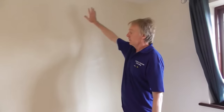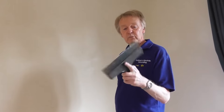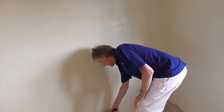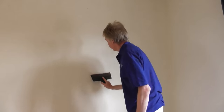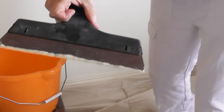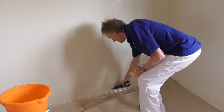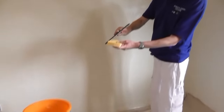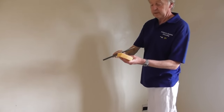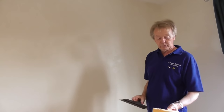I've already soaked this part of the wall with some warm, clean water. Now I'm going to be using this tool to get the paste off - it's called many names in the industry: wide filling knife, wide scraper, etc. It's quite a handy tool. I start at the bottom and pull the tool up the wall like that, then push it to the top of the wall. Look at all that paste that's come off! Now all I do is wipe it off into the bucket with a sponge and do the next strip, working my way across the wall. That's as easy as that. I'm going to carry on now and complete the rest of the wall, getting all that horrible nasty paste off.